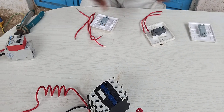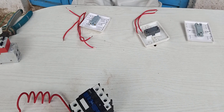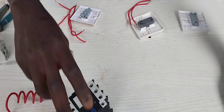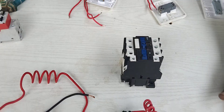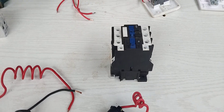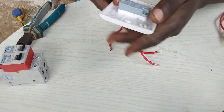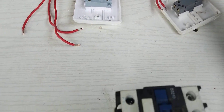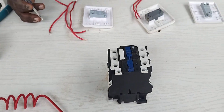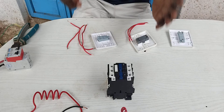There are so many entries and those entries need switches, right? You need to control those bulbs — there are so many bulbs you need to control using one switch, but that switch controls several lightings. Now I want to introduce a contactor. This contactor will be holding those bulbs, those lightings. You can have so many lightings that would burn out or overheat your switches. Remember this switch can only carry a maximum of 10 amperes. For example, if you have 100 lightings drawing a maximum of 100 amperes.